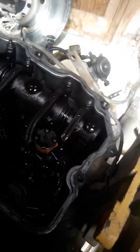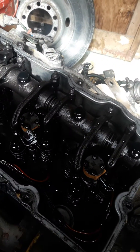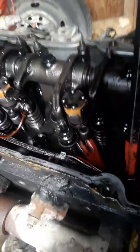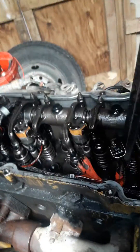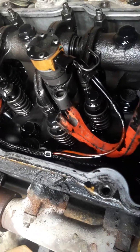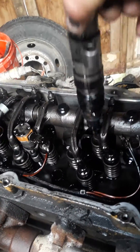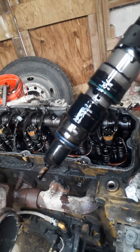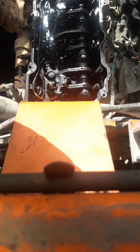I'll show you how to slide it back in on the other engine. Just in case you missed it, I'll show the removal again on this engine. Get your crowbar underneath where the bolts go in, pull it back - it feels like you shouldn't but that's what you do. Pull it up for the first pop, then rest it on top of that head bolt and give it another little pull up, and that gets it all the way out. Then just pull it out just like that.